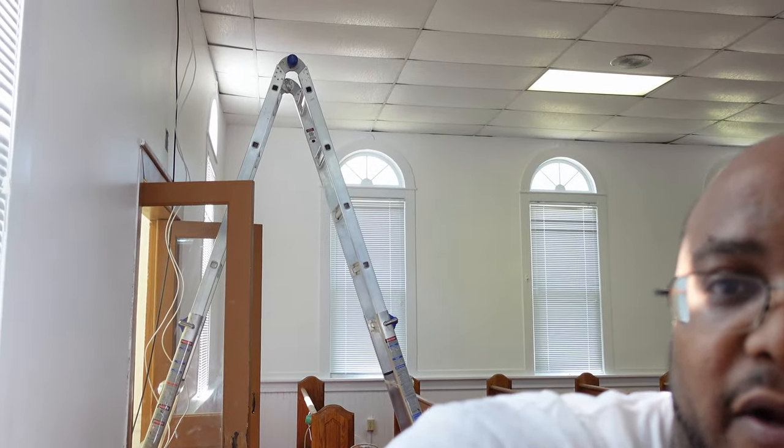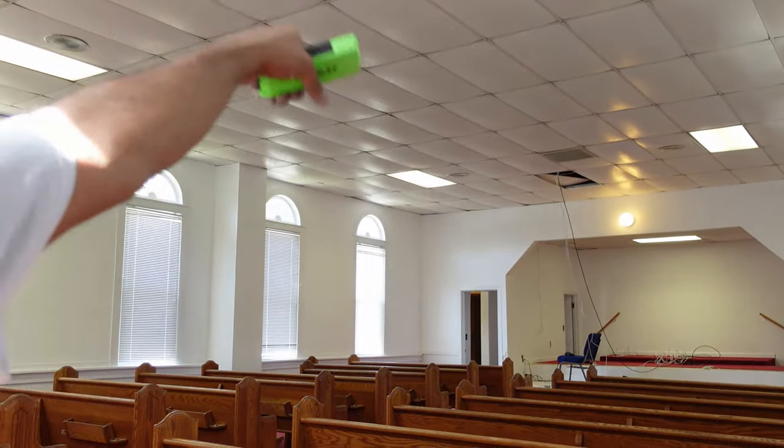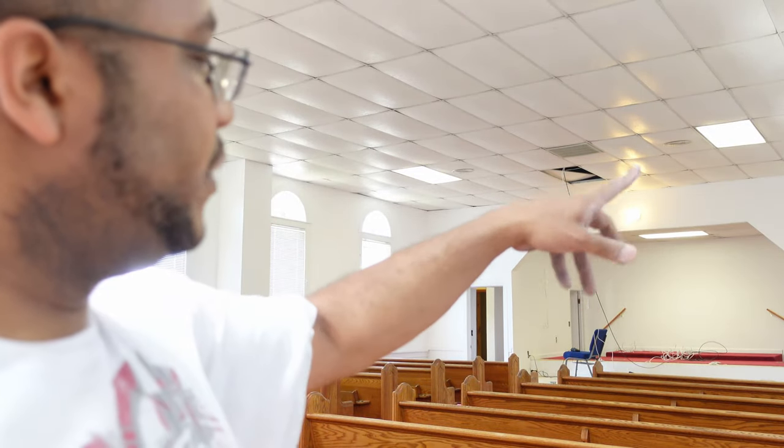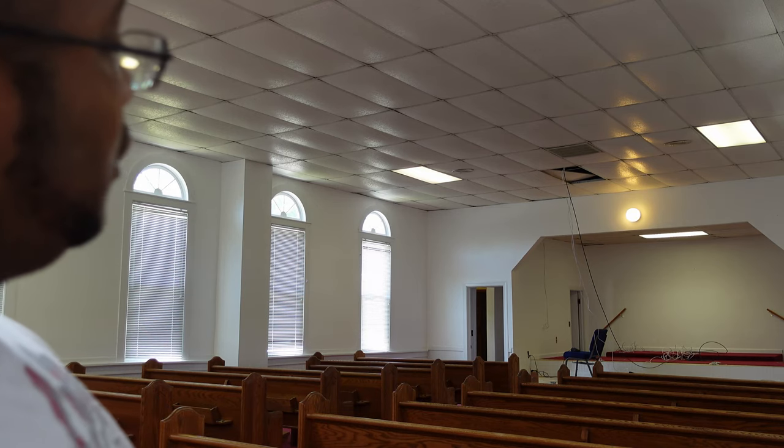We got the cable pulled in the ceiling — we got it right there in the front and in the back, where I'm going to put some conduit. I can't find my electrical tape, so I need to put some electrical tape around the grommet to make it just wide enough to stick inside the ceiling tile. I'm going to put something right behind that hole that we were trying to do a pass-through on that didn't work, and then put a plate over top of where I was going to put the two-gang box. In the front I'm hitting a wall, so I have to put a hole right there to reach into the next section right under where the choir loft is. I pulled more than enough cable, so we can connect it and run it over to where all the other wires are.